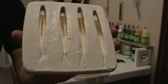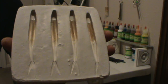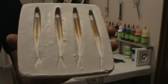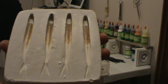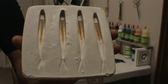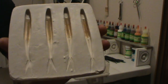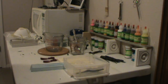If you try to pour a bait in a mold that's not sealed, it will bubble — the plastic gets in there and causes the bait to bubble. You can pour baits in there 15 times and they're still going to bubble every time. Also, when you pull the bait out it doesn't release — the plaster holds on and you get little pieces of plaster in your bait. So you definitely need to seal it. There are other things you can seal with that I'm still experimenting with.